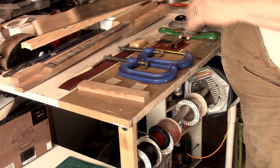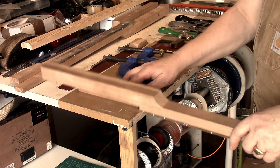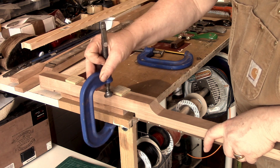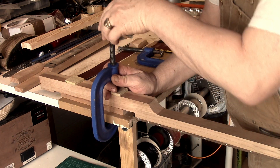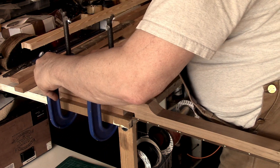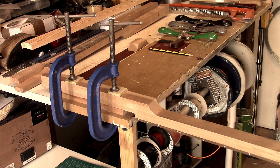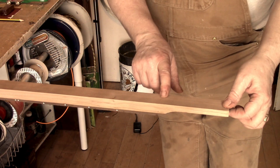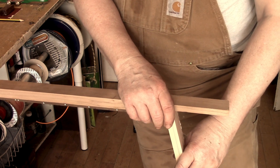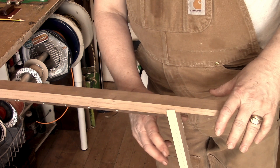The very first thing we do is fix our neck down so we can work on it. I've got a little packer here to raise this so the neck sits parallel on the bench. A couple of packers and a couple of good cast iron clamps — you can use speed clamps, the pistol grip type, but I really always prefer a good cast iron clamp. That's our work fixed on the bench, not going anywhere. If you want to stop the piece moving around, you can simply prop a piece of wood and tap it in underneath to help stop that moving about.